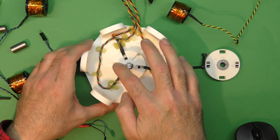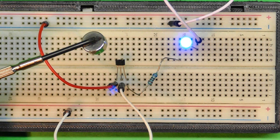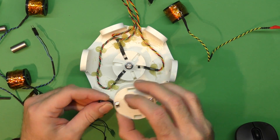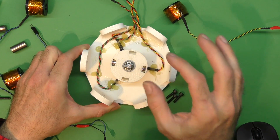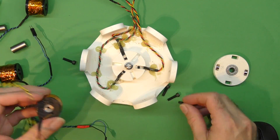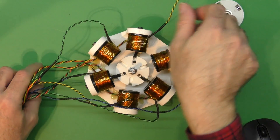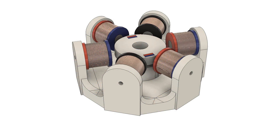For prototype work, I've got myself three Hall sensors. They work exactly the same way as the reed switches — they just switch their output when they see a change in magnetic field, only they do it electronically. I've glued them into the 3D print, each 120 degrees apart. That means when I put the rotor on and it spins, I can tell to within 60 degrees the position of the rotor. Being able to find your rotor angle from the Hall sensors is really only solving one of your problems, because you've then got to figure out how to use that information to sensibly drive the coils surrounding the rotor, so that you end up with a rotating magnetic field effect, which the permanent magnets on the rotor will then just follow round and round.